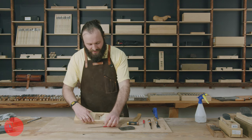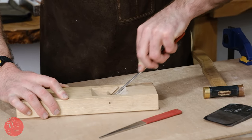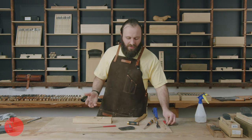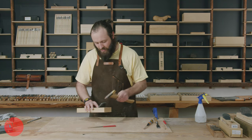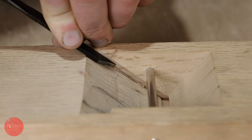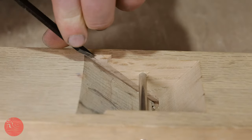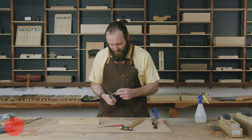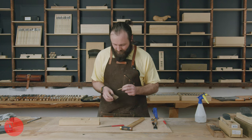Now that we've got those dark areas removed, we've also got a light dark area here on the base — very small, about a centimeter square. I'm going to remove that dark area and the little one on the other side as well. This is going to be a process of rinse and repeat as we sneak this fit up to have the blade nicely fitted and the edge protruding. As we remove these dark spots we are losing pencil from the process, so I'm just going to make sure I've got plenty of pencil on the side and on the back of my plane blade, and repeat.